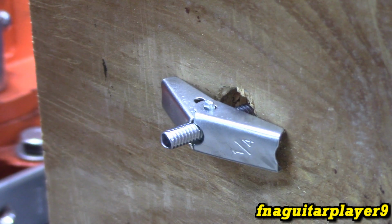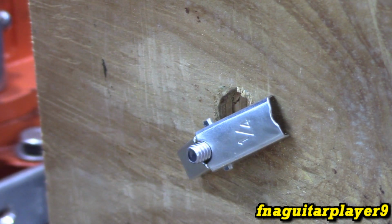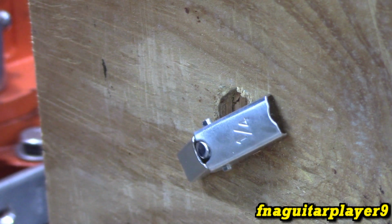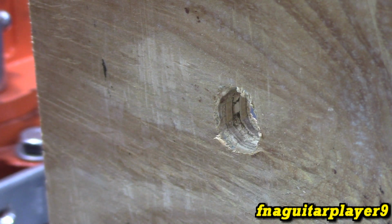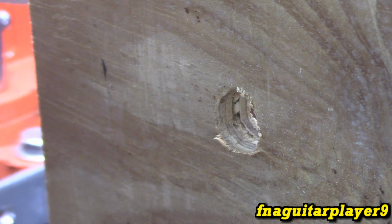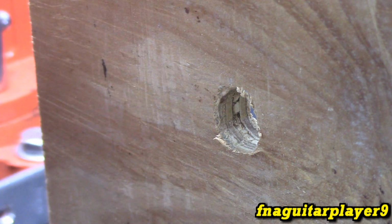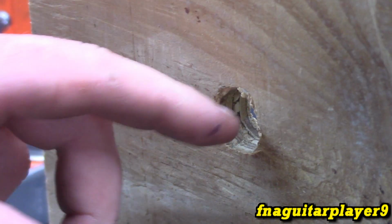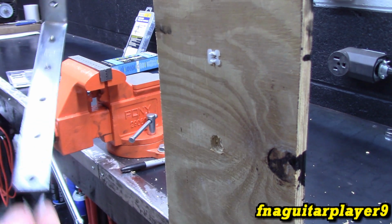But the disadvantage, if you ever go to loosen this bolt, mind you, you're looking at the inside of the wall, so you loosen this bolt, it just fell down inside your wall. So in order to put another one in, you'll have to go buy another one if you don't have it, and do the same thing again. Whereas with the other type, the anchor stays in the wall. So that's really the major advantage of it.